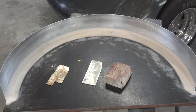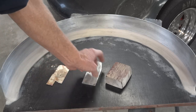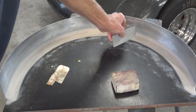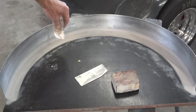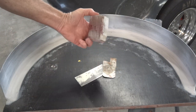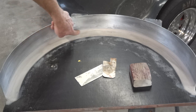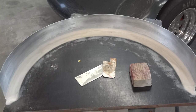Here's our wheel arch mould ready for painting. It's now got a little fillet made out of body filler which has gone in there to give it a bit more shape rather than just having a 90 degree edge. That goes in with a little tool with a 15 degree chamfer to make a 15 degree fillet, then a little tool with a 15mm radius to make the radius in the corner, and a little curved sanding block with some sandpaper and a bit of fuel hose with paper wrapped around it to help flatten and sand the radius. So that's ready to paint.